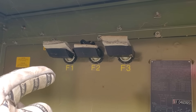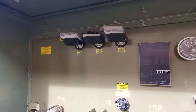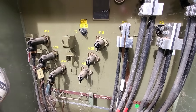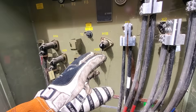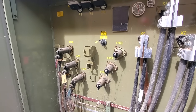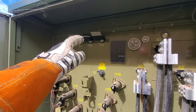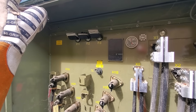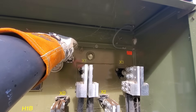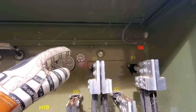If you do remove those fuses, there's a lot of pressure inside the oil tank. Most transformers on the power line system are oil-filled — there certainly are dry types, but most of ours are oil-filled. If you go to pop that fuse out, you might have hot oil squirt back at you. So the first thing you want to do is drain the air pressure — that's what this pressure release valve up here is for. Grab your hot stick, clip onto it, and drain the oil pressure first.